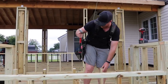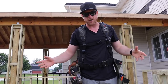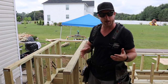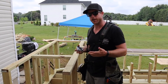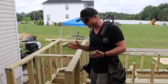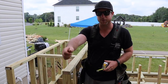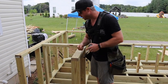Yesterday while Tony was finishing up sheathing this roof, I got started on this outdoor kitchen. Come on up, let me show you what we got. What I did here was look at all the things that are going to go in here - the homeowner already purchased those, so I was able to measure each appliance and make sure that we frame around it so that everything fits in here nicely. We have a fridge that's actually going to go in the side of this island. Pat's standing right by the door of the screen porch - you're going to be able to open that up and access this right in the end.